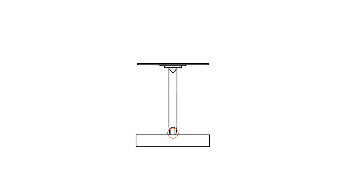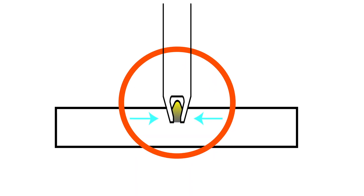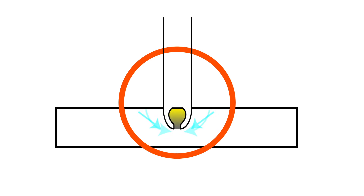Let's talk a little bit about how a grip nail mechanical fastener works. First, the grip nail is impact driven through the duct liner and into the sheet metal. Then we'll see how the tapered teeth clench the sheet metal to form a ball and socket connection. When fully set, the grip nail withstands up to 120 pounds of withdrawal resistance.